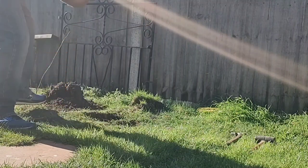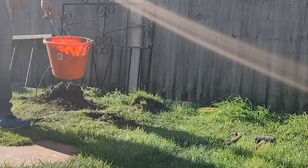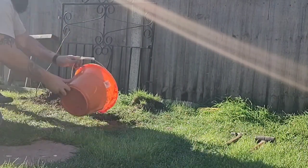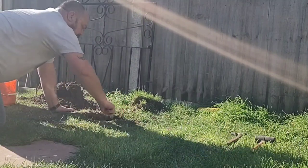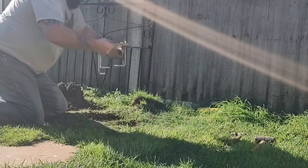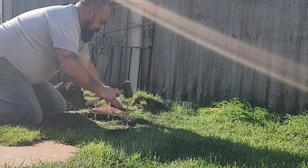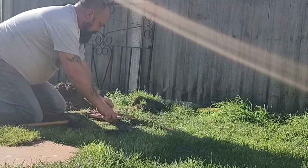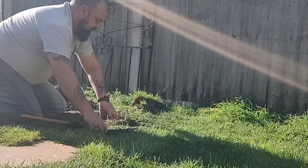Pour some nice wet concrete into your pre-dug hole. Bring it up to the level that you want the concrete to finish at. Here comes that template with the threaded rod — it's starting to make sense, isn't it? Push this into the hole. Make sure all your bent bits are pointing towards the middle. You can check this because you've marked one side of the threaded rod — just turn them around to make sure all the little marks are pointing into the middle, and you know the bent bits are pointing into the middle.